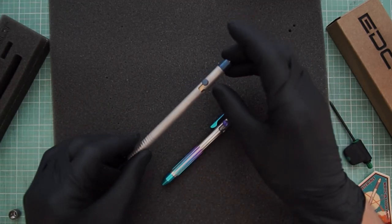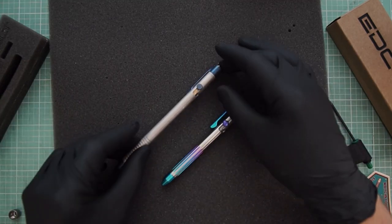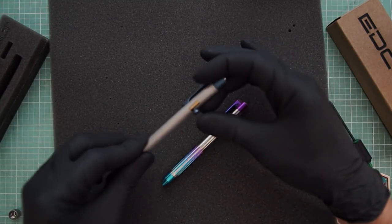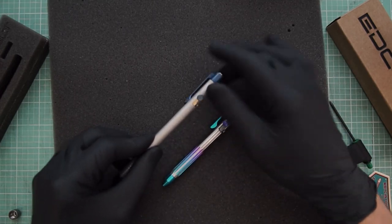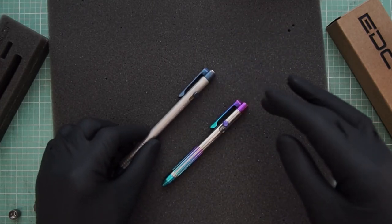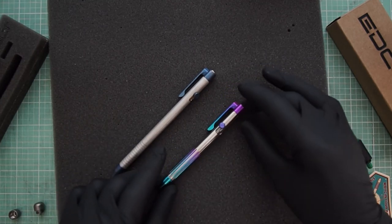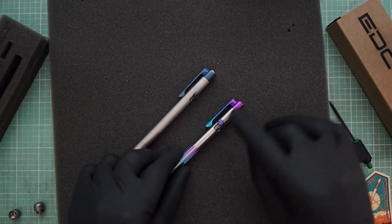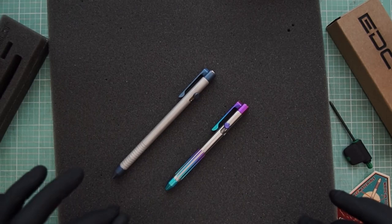This is made out of tube stock — stainless tube — so the inside didn't really have to have a lot done to it. It had a texture that lent itself well to a sliding action, smooth enough with the brass pin. Whereas this one is made from rod, so I drill out the bodies on all the pens now. This was drilled, reamed, and then polished to get a really smooth action. I'm really pleased with how these are working out.